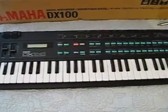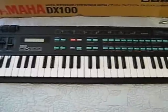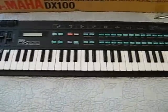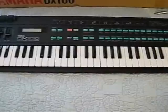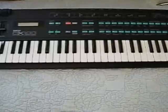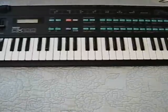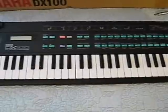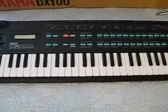The first thing you want to do with your keyboard — if you have any sounds in there that you want to save, you're going to want to back those up and put them on some other kind of storage device, because once you take that battery out, you're going to lose all the memory and all your sounds that you had saved on there. The only thing you're going to have is the internal sounds that you'll reset once you put the new battery in.